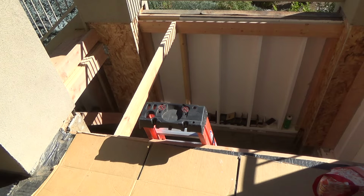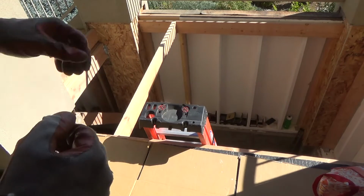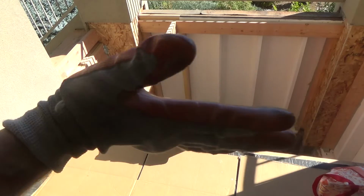So I wouldn't want to go 3, 4, 5 if I've got a room that's 80 feet by 40 feet or something like that. I wouldn't want to go 6, 8, 10. I would want to go like 12, 18, or 12, 16, and 20. I measure that off, and I have somebody help me hold the tape measure really tight, and then put a little pencil mark on the strings, and then I'll continue the side, and that's how I get my square.